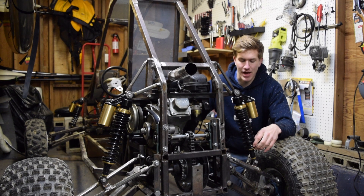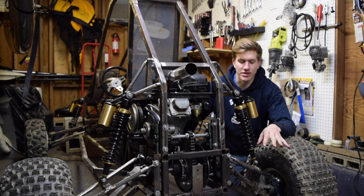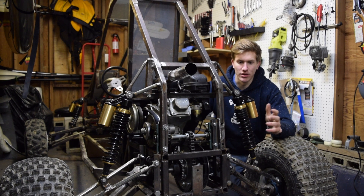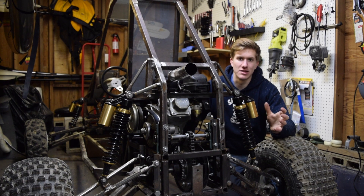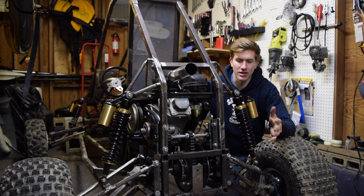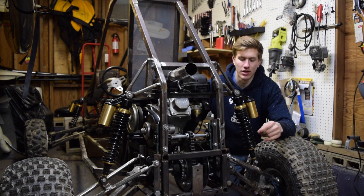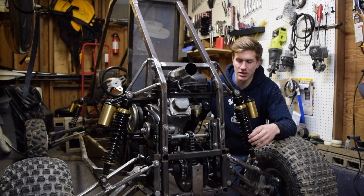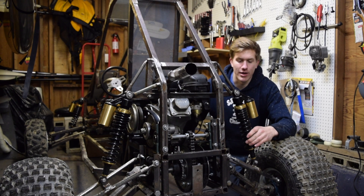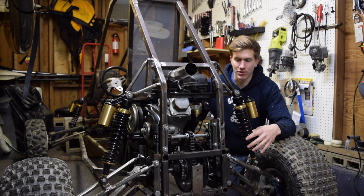This essentially allows you to have two-wheel drive constantly when accelerating in a straight line, and when turning, all power is transferred to the inside wheel. Now this might not sound good; however, if you're in a low traction situation where the inside wheel were to begin to slip, that ratcheting mechanism would catch up with the outside and you would regain traction with both wheels. This would be a constantly occurring system, so you essentially have a method of mechanical traction control. This is a really great system for low budget applications — it cost me no more than $30 to make and it works just as well as a thousand-plus dollar limited slip differential that you could buy for a trophy truck.